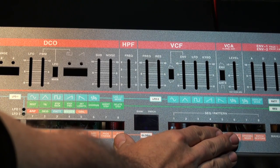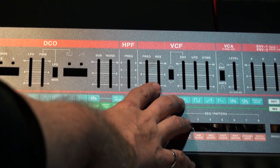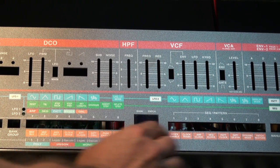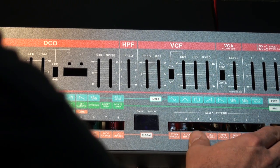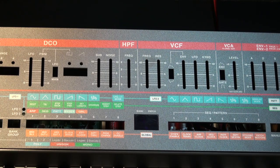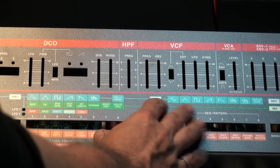Now, the technique that I use is I remove the panel board. That much is what I already talked about. And with the panel board gone, you can now line up all the holes in the overlay with the existing holes in the metalwork. And that's really important because Roland's tolerances were not 100%, like anything else. This is before the era of CAD CAM, so we're talking about stamping machines and whatnot. So there is little slop in there. So this overlay does a fantastic job